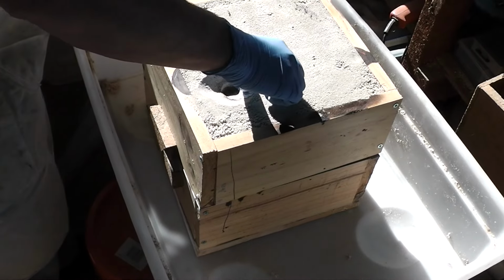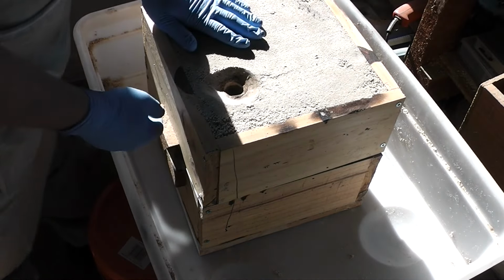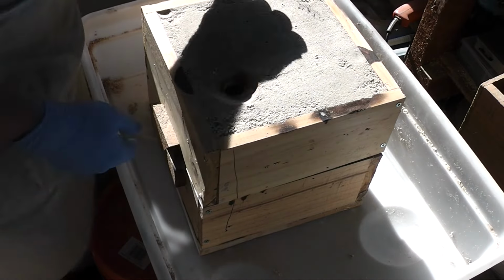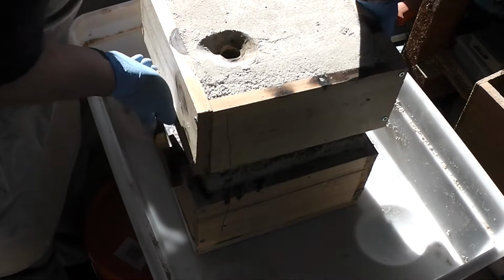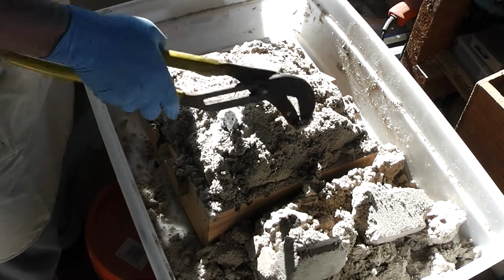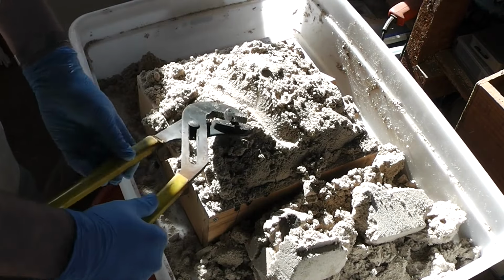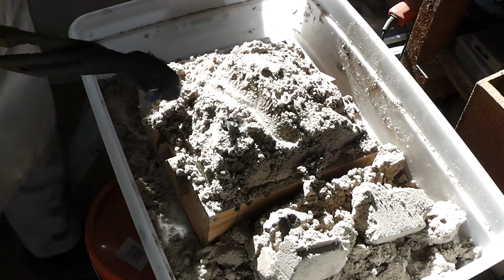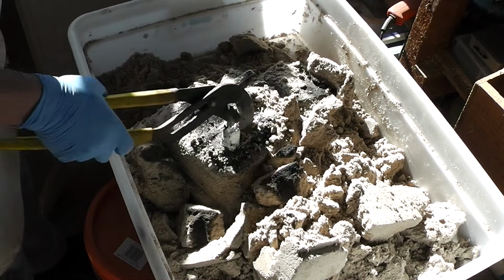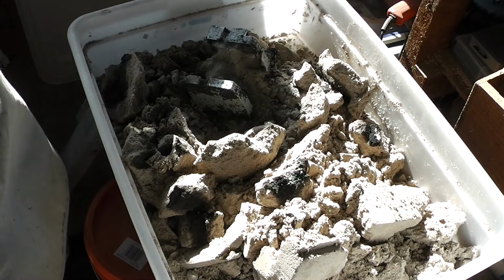Right, third attempt at this, hopefully third time lucky. As you recall, I had 3 bricks on this to help stop the blowout happening again. Look at how far the gate shrank down. It was acting as a feeder to supply metal while the whole thing was cooling off. Oh, this looks promising. The casting itself is still screaming hot.